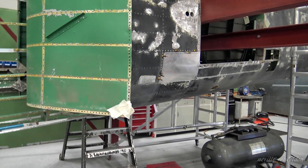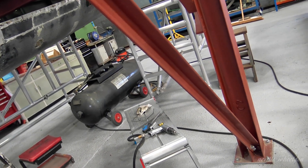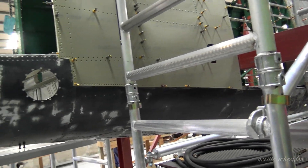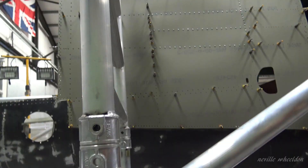Getting the skins fitted now — yeah, doing the patches, doing the last one. The big skin right across the other side that Les was doing — we started riveting that on Thursday. He got it painted and it's all painted. So on a job like this, whereabouts do you start riveting? In the middle and work out — find where the center is, there's a middle line of rivets, work from the middle out, pop the middle out, then keep doing that line and spread out from there.